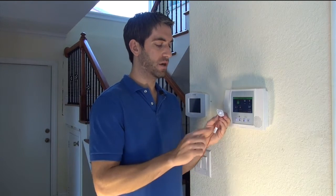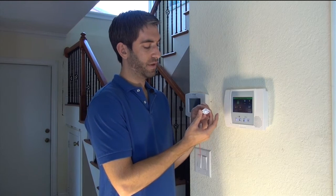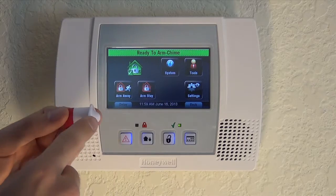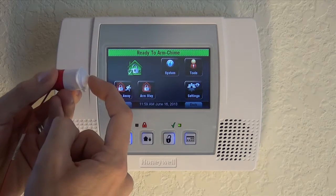This is a very different type of sensor. All it has is a contact with a plunger switch. You use this in a door or a window and it's a recessed mount, so different than a surface mount. You actually drill it in and it's hidden when the door or window is closed. Instead of using a magnet, it has a little switch activation inside.